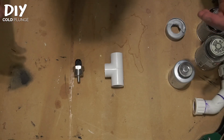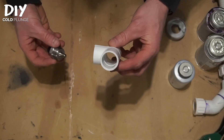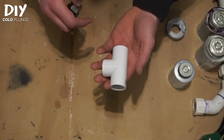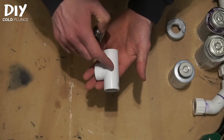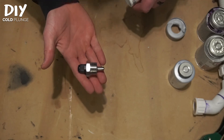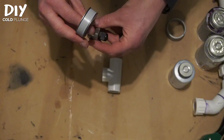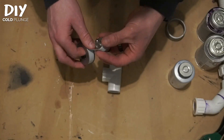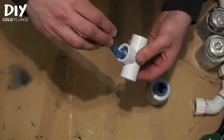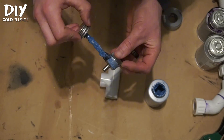To have inline temperature sensing on your DIY cold plunge, two things you will need in addition to your normal plumbing setup are a fitting that has two socket connections and a threaded connection — I'm obviously using a tee for this, but you could also use an elbow with the threaded part going down — and of course the thermocouple, which I've linked in the description below and you can get on Amazon. I'm attaching these together with PTFE tape and thread sealant, which could be overkill, but I did not have any leaks when I set mine up this way.